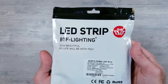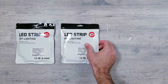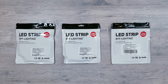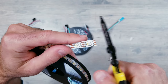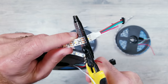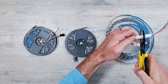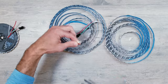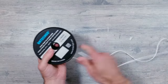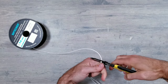For the lights I'll be using some of my favorite 5 volt SK6812 strips from BTF Lighting. For this project I'll need three rolls adding up to 15 meters or close to 50 feet. I'm cutting off the lead wires by snipping off the first LED on each strip, and also cutting off the last LED on each strip to remove those end wires. Then I'm taking some 18 gauge silicone wires and cutting three sections each approximately 8 feet in length, which will get connected to the beginning of my LED strip.